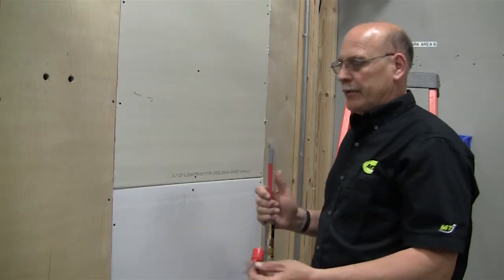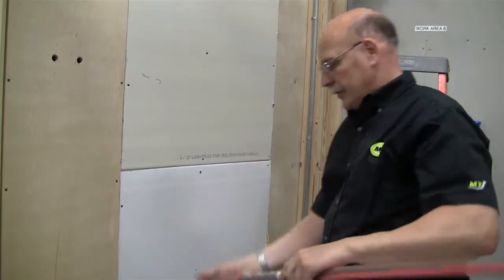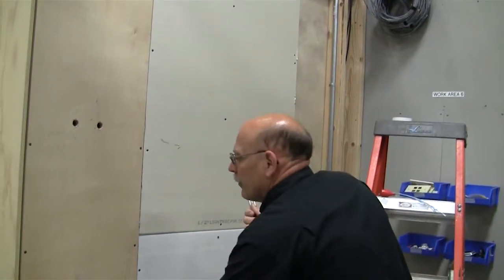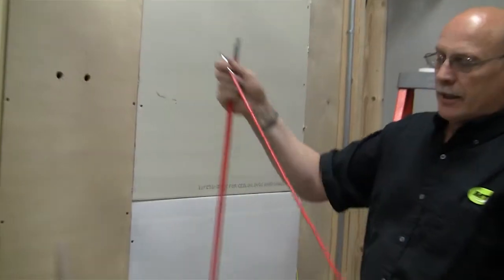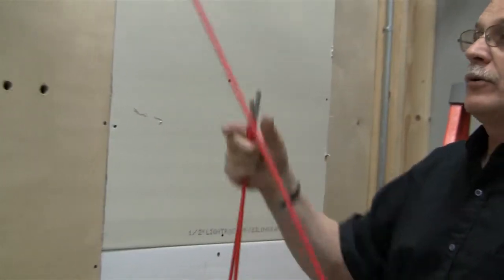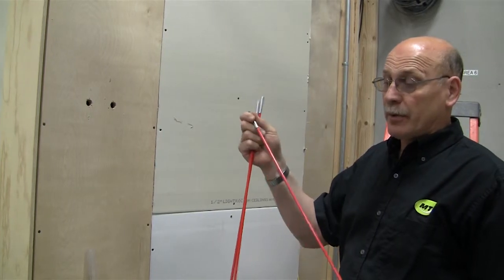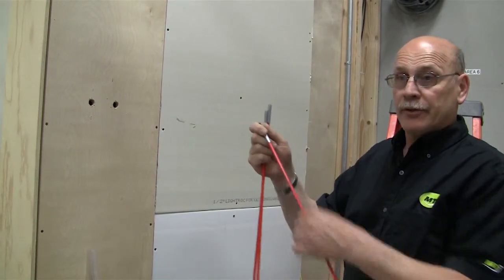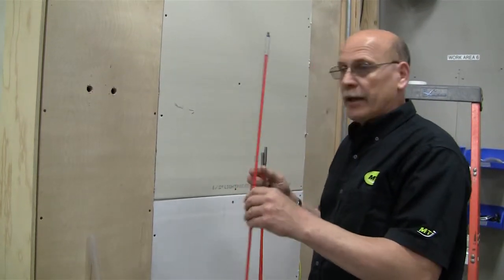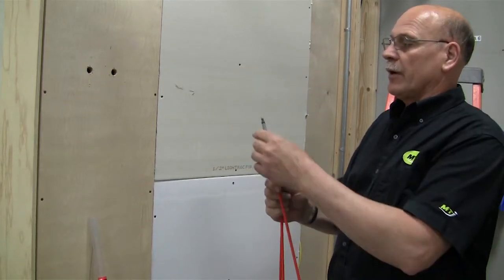Okay, for the wall part of the installation, if you've ever used any, they're called fish sticks. If you've ever seen them or not used them, they're fiberglass sticks. They only bend so far, but they're flexible. So one thing you do not want to do is run these through the conduit. They do not take the corners, they will break. They're very dangerous if they break, because it's fiberglass. It's not like a wood sliver, so be careful with these as far as breaking them.